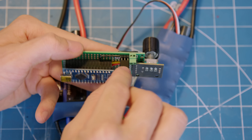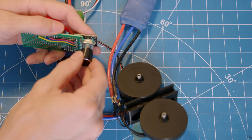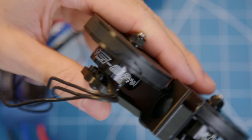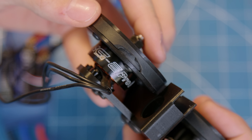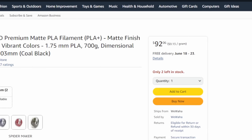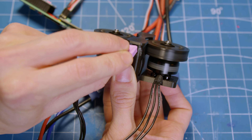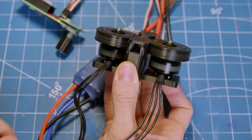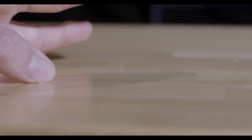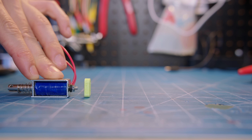While the finished product will have removable magazines, I wanted to start with just one piece of candy at a time to see if this idea even works. It absolutely did not work on the first try — the wheels decided to launch out chunks of the rubber tread I had made instead of the candy. So I swapped out the rubber for some 3D printed treads using an eye-wateringly expensive TPU filament and tried again. This introduced a completely new issue where instead of going flying, the candy would just get spat back out into my hands, or even worse, just chattering around inside the barrel. To fix this, I figured a swift kick was all the candy really needed, and if you translate swift kick into electromechanical speak, you get solenoid.